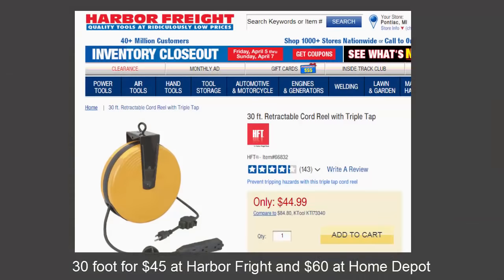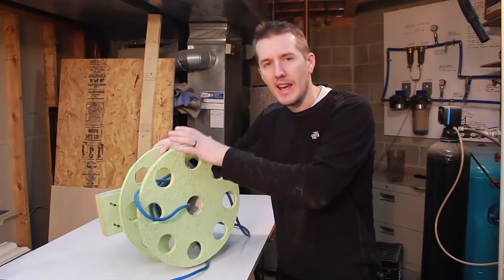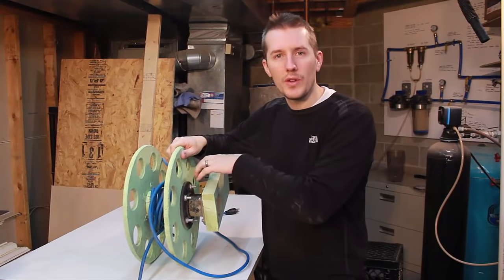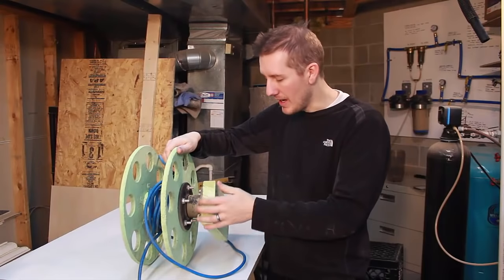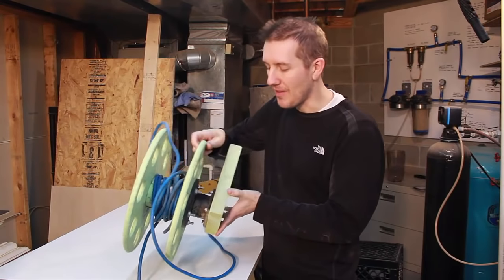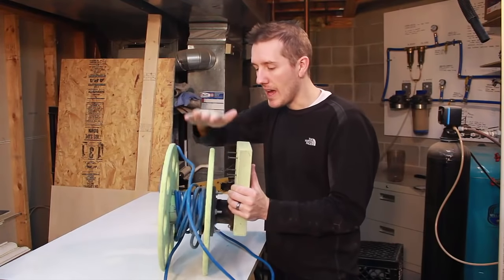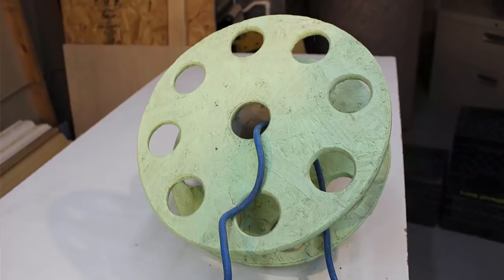I built it because the cheapest extension cord reel you can get is probably around 50 bucks — even the one at Harbor Freight, the 50 footer, it's like 50 or 60 bucks, which isn't cheap. Hopefully you can get an old extension cord and use that. The heart of this unit is an old car hub — a wheel bearing out of an old car. I changed it on my Grand Prix. You don't need something this heavy duty, but this is definitely robust enough to hold up 20 pounds of a reel. The mount goes to the joist and the reel itself is just OSB particle board and a piece of PVC pipe in the center.